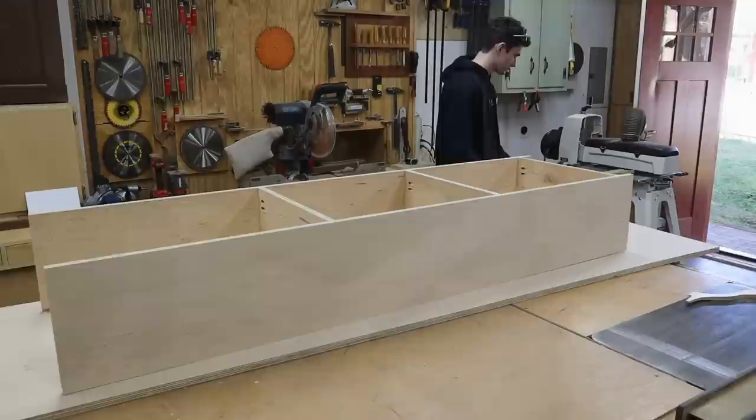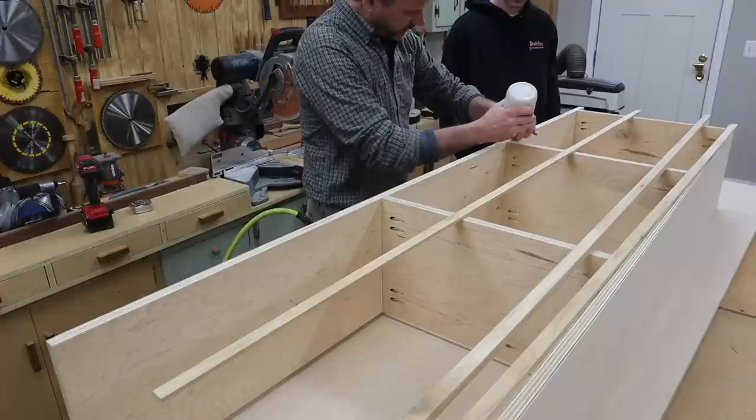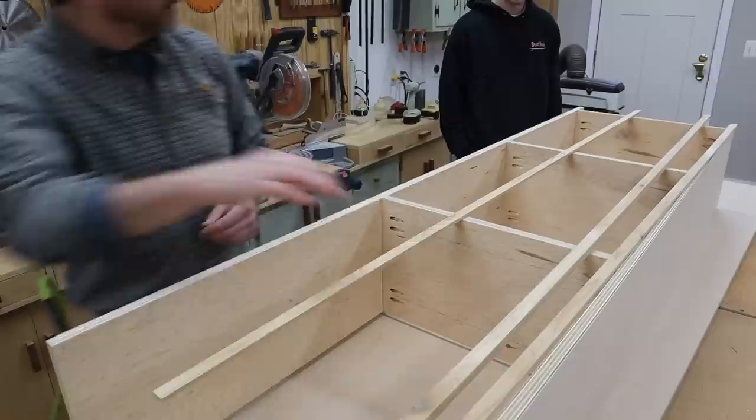So I'm going to attach this one piece of trim, then I'll leave you alone and you can film and trim the rest of the cabinet. This is a little trick. You can get a nice bead of glue by using your finger as a guide. See how the glue line is right in the middle? You don't need to use a ton of glue. And anytime you use glue, you should have a wet rag next to you so you can clean it up if it squeezes out.